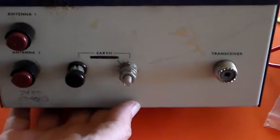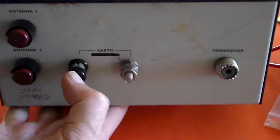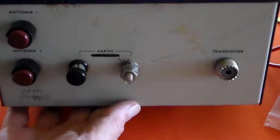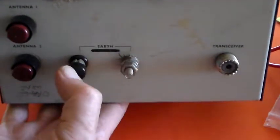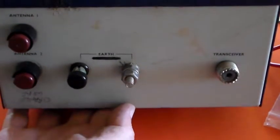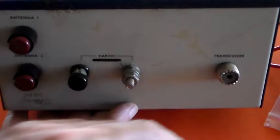If you were going to put it on a boat, this is an RF Earth and this is the DC Earth — the chassis Earth. So if you don't want to connect this to your boat hull, this is the RF Earth and this won't be making your sacrificial anode fizz under the water with the DC current from the power supply for the radio that's connected to this thing.